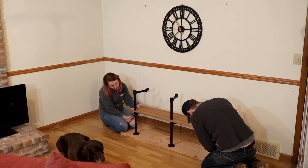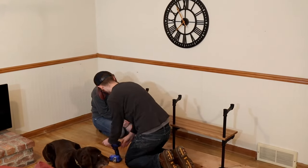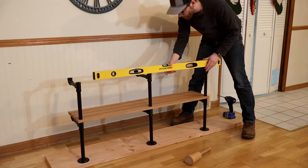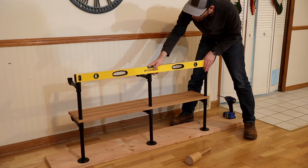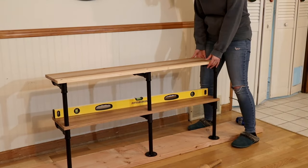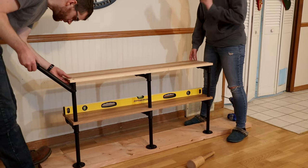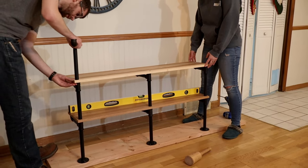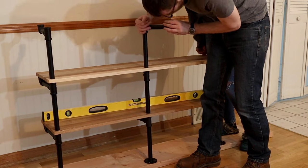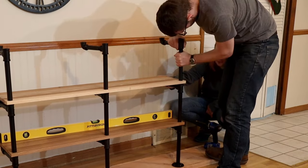To help with assembling the shelf, I first bolted the foot assemblies to a 2x12 board to keep everything upright. This is a really important step because this bookshelf is not freestanding, and bolting it to something while assembling all of the shelves makes the job a lot easier. I installed each shelf support through the wood shelf and turned it until it was tight. That is a tongue twister. Before moving to the next level, I checked that everything was level. To fix any uneven shelf supports, I just had to rotate the assembly another turn until everything was perfect. Then I could continue this process up the bookshelf until I got to the top.